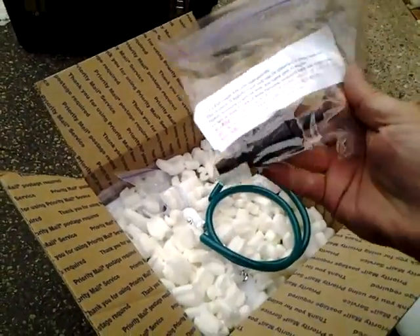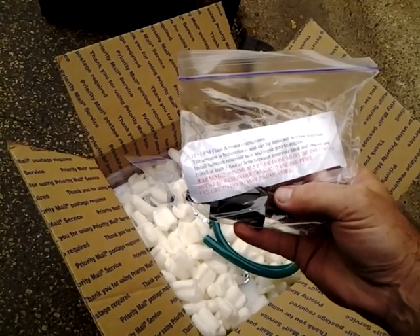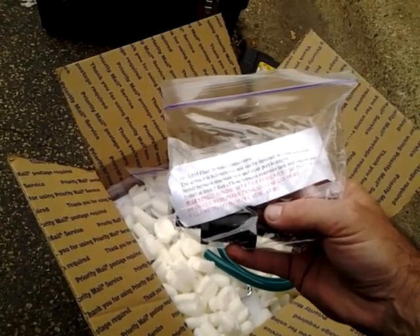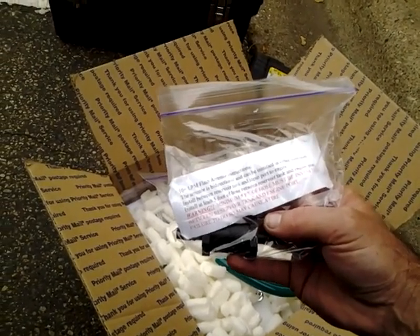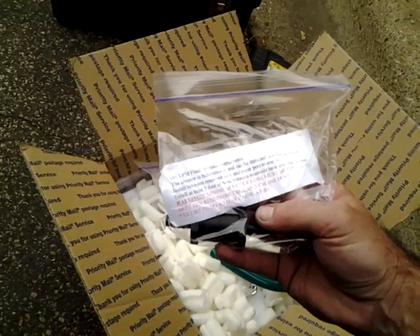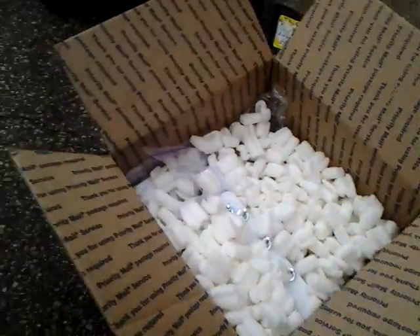Our flashback arrester — ten-plus liters per minute flash arrester. Instructions say it's bi-directional and can be installed in either direction. Install between the reservoir tank and the input port to the engine. Install at least five feet of hose between the reservoir tank and the engine port. Failure to do so may cause a fire.